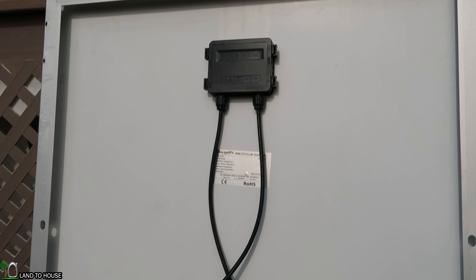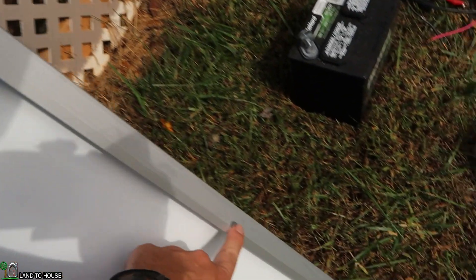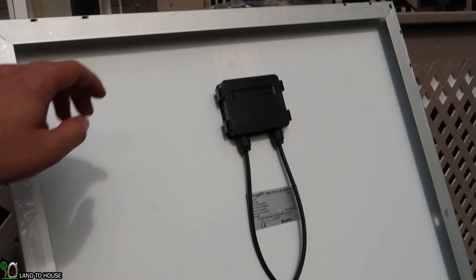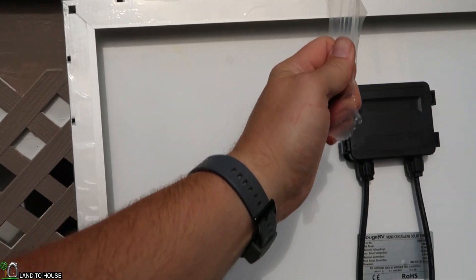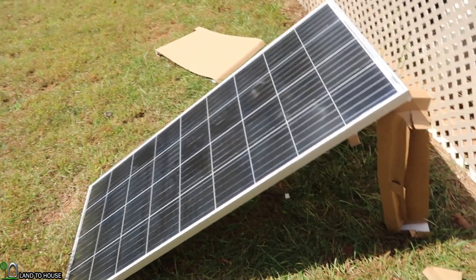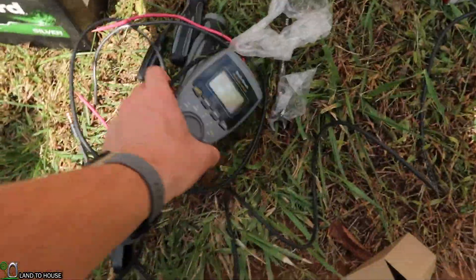The length of those wires looks like it's about three foot, so that should give us plenty of room to work with. For mounting holes, it's got one, two, three on each side, so you can adjust how you mount based on those. Everything seems to have come through shipping just fine. I think it's time for us to go ahead and get these connected and see how well it charges a 12-volt battery. For the sake of this video, I just have the panel propped up a little bit on some cardboard to get into the sun. Let's see what this panel reads here on the multimeter.